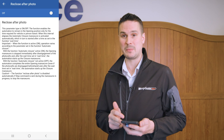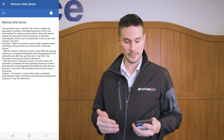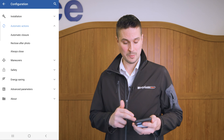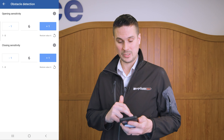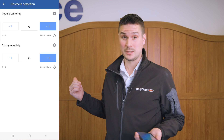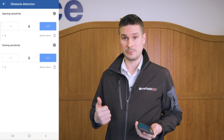Re-close after photo is a feature which enables the gates to automatically close or force a closure if there's been a power cut and the gates have been stuck open — we can switch that on. All of these parameters will tell you exactly what they do when you go into them. We also have safety settings for connected devices and obstacle detection. We can set the force settings on these motors to make them more or less sensitive to obstacle detection. For instance, with these fully boarded gates, we may want to reduce the sensitivity to ensure they can cope with windy conditions.